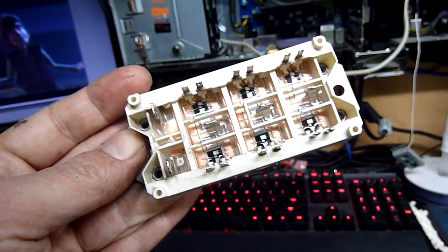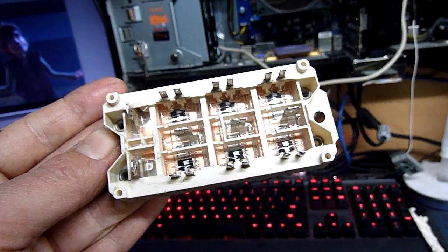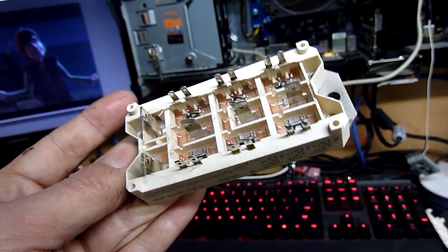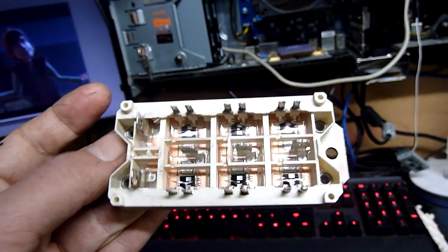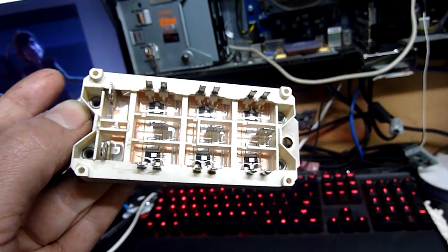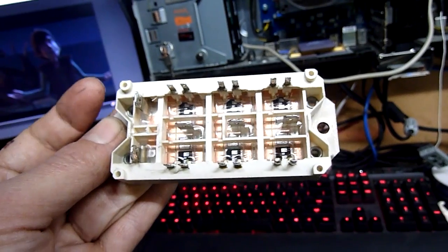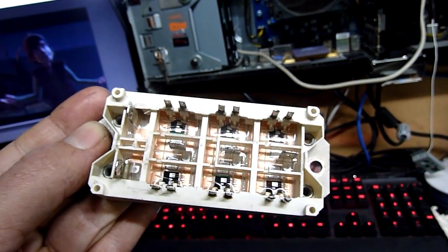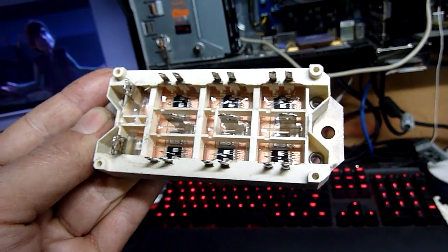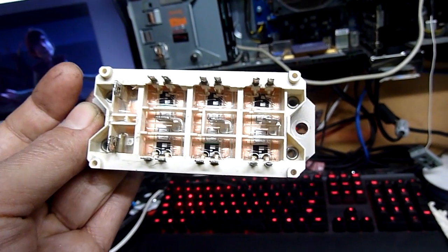In all honesty, this strikes me as basically a very expensive version of an inverted DC drive from an air conditioner, just with PLC control and the ability to do incremental steps, immediate stop and start, and high acceleration and deceleration. It's just a smart version of an inverter drive — a DC drive. You'd also find a very crude version in a washing machine. It's three-phase BLDC output — BL meaning brushless — with very stout windings, permanent magnets usually neodymium, very stocky and torquey little motors. The more I learn about DC drives the better I'll be able to explain it. Thanks for watching.